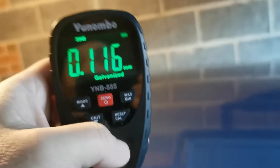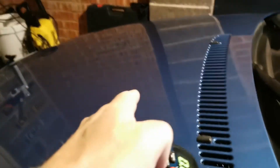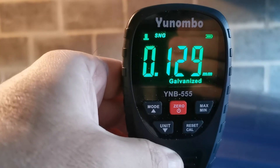The point of buying this is if I'm going to machine polish somebody else's car, I want to know all about its bodywork - has it been painted somewhere? Just because the bonnet has got twice as much total depth from the lacquer all the way down to the metal, it doesn't mean there's twice as much lacquer on there. There could actually be less lacquer there than on the original roof paint. You don't get to do test areas with this, so let's have a look on the door.